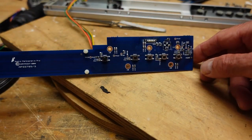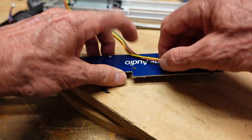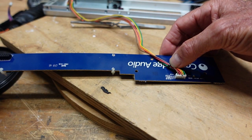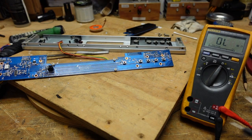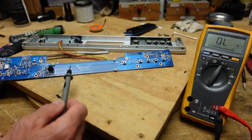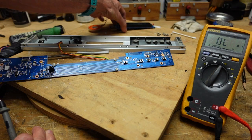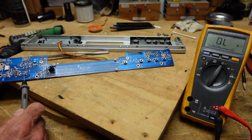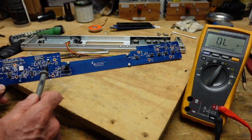I'm trying to trace the short circuit that's on this board. Our power supply comes in here — you look at the back here, it says ground and five volt down there. I was able to go through the board using my meter. What I discovered is that this track along here — I ended up pulling the display off, so that's not part of the circuit anymore. I still had my short, and I discovered that these links right here, link two, I could lift, and that would lift the 5 volt, which goes right up to here. We have test points — ground and five volt here.